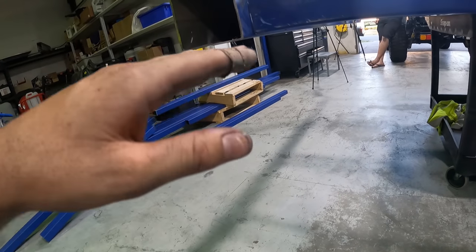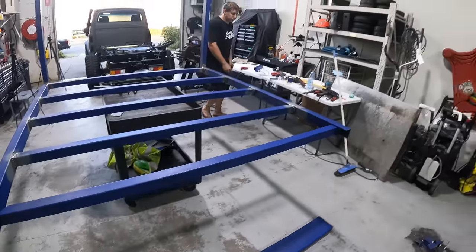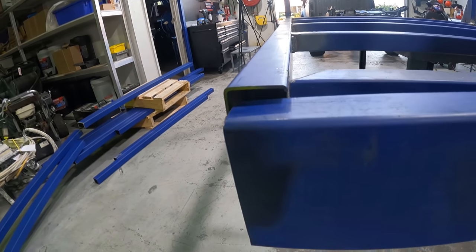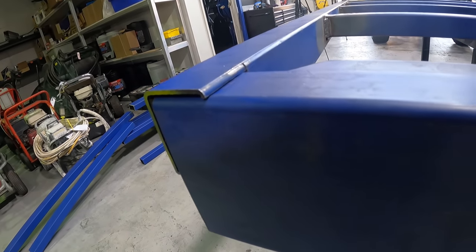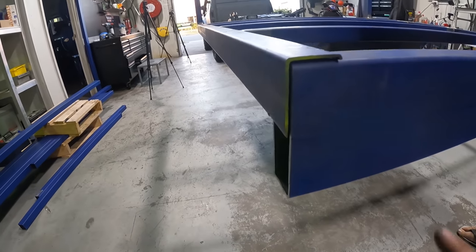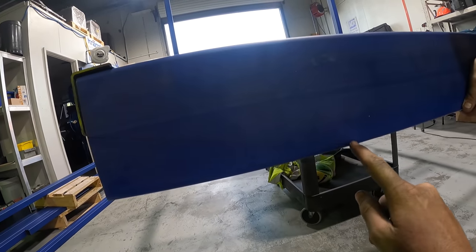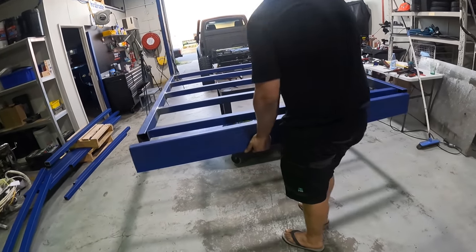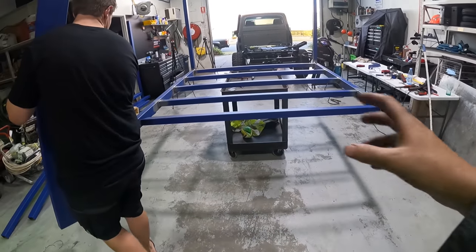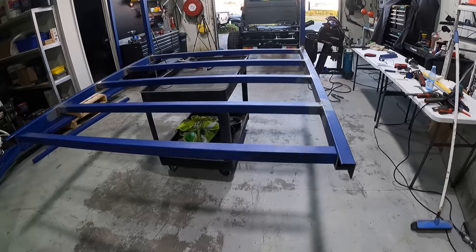The way that this rear section is going to work is this box here. I've marked, yeah, you can hold it up, mate, and notched it on both sides with a 4mm rebate once again here. That will just sit in there. It'll get fully seam welded across here, and then our taper will start on the bottom here, which is a 300mm taper. That way we've got plenty of room to mount the lights and the number plate and all that sort of stuff.